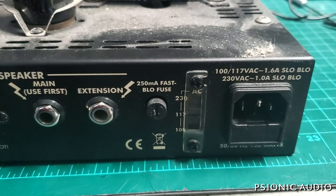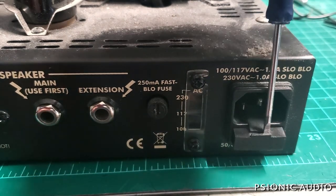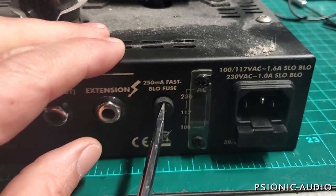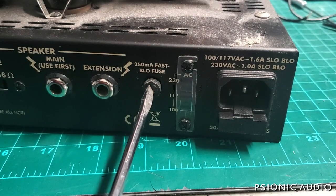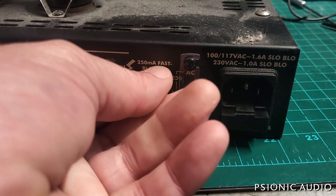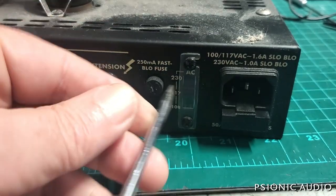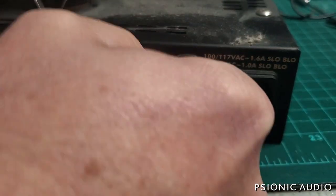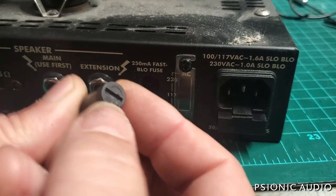There's a lot of dust on top of the chassis — I'll clean that off. Before I do anything else, I'm going to point out the fuse locations: one in that drawer and then one right here. I'm using different size flathead screwdrivers to get those out. This one doesn't want to come out easily. That's tight and that's loose. It was already loose when it came in, so that might be the entire issue. The fuse is a little bit chewed up — someone's been in there with too small a blade.